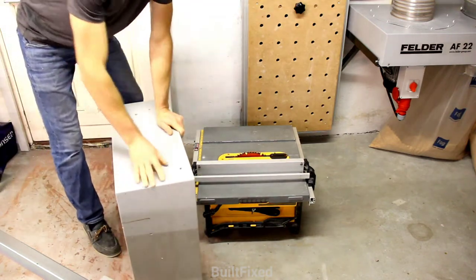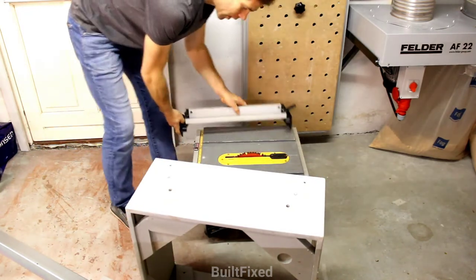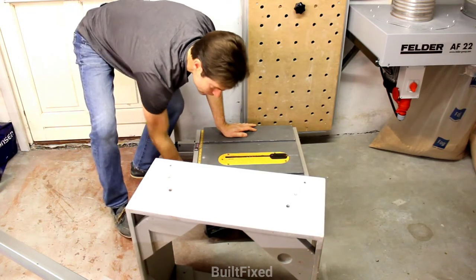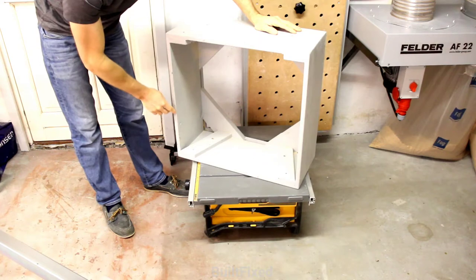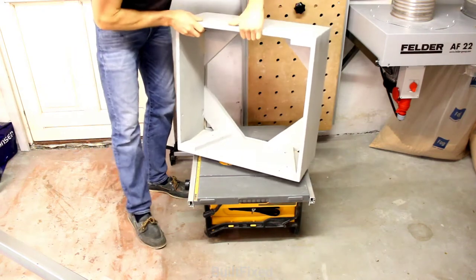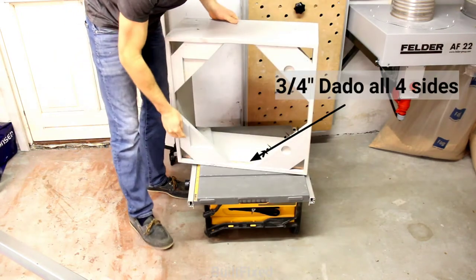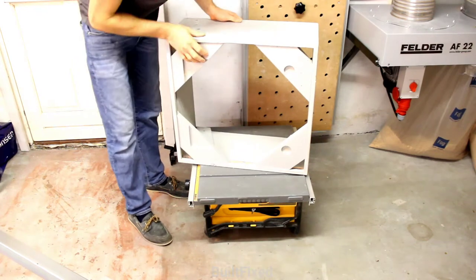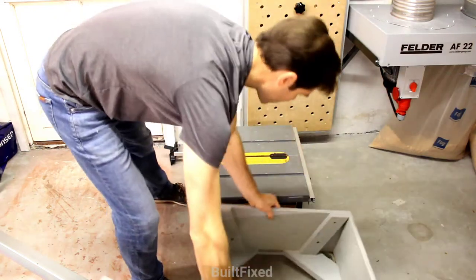At the end of this video, I will go through and give some basic measured drawings and show how you can assemble your own box for your table saw. The box consists of just a few pieces of plywood and a few miters to keep it stiff. I chose to create a dado in the back to accept the pieces here. And I wanted my stand to also double as a storage container.